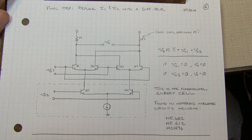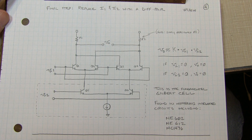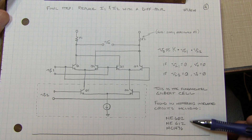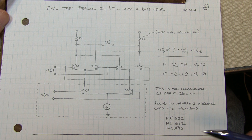This works best if all transistors are matched, so it often appears as an integrated circuit. Some of the most common places where you'd find it are in the popular NE or SA602 or 612 mixer and local oscillator devices, also the older MC1496, and in countless other circuits where it may not even be specifically called out. This analog multiplier circuit is found in many, many places.